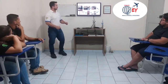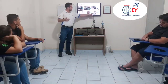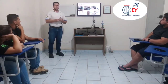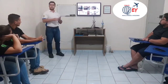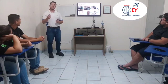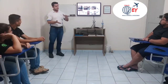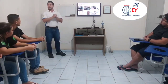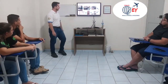And in this transportation, you have many machines, but this is one machine for you to measure the wheel. Why measure the wheel? Because you measure the radial and lateral runout, upper, lower, and average, and the first and second harmonics, radial and lateral. You measure the width of the wheel and you also measure the offset. And to finish the measuring, you take the wheel back and send it to customers. Maxion works with many customers.